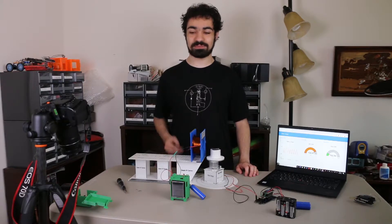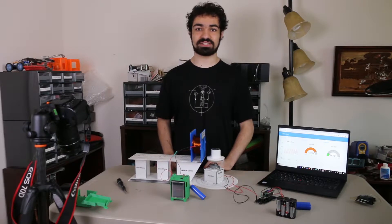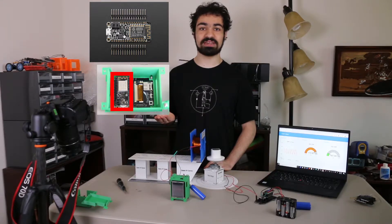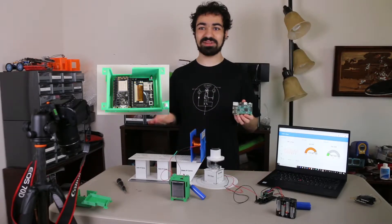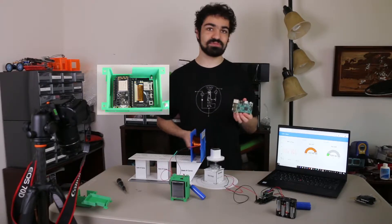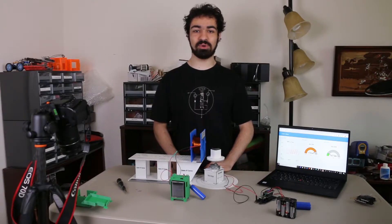The wireless communication happening between the EMF meter and the computer is enabled through two different devices. The first is the Adafruit Feather Huzzah, which is what you'll see when you peel off the ADS-1115 featherwing. The second is the Raspberry Pi 3, which acts as a host. The Feather Huzzah sends data to the Raspberry Pi, and then the Raspberry Pi communicates this data to a single Wi-Fi network, through which any device hooked up to that Wi-Fi can see the data graphed on a computer. This means if you have a phone on the same Wi-Fi, you can access it and see it on mobile as well.